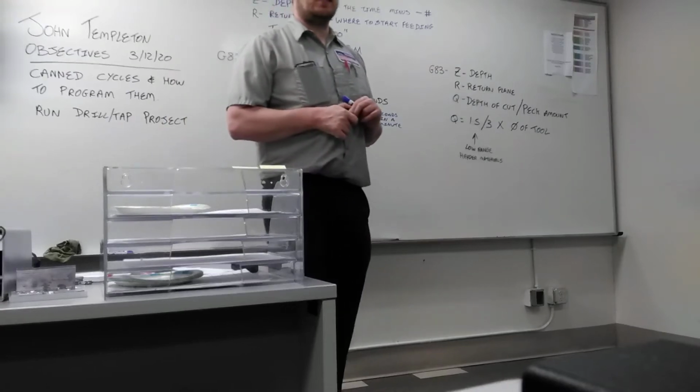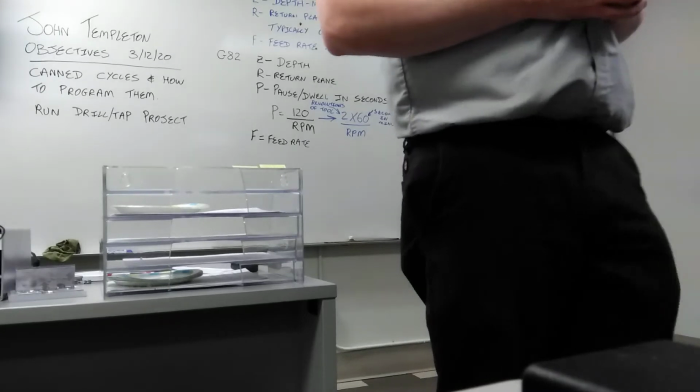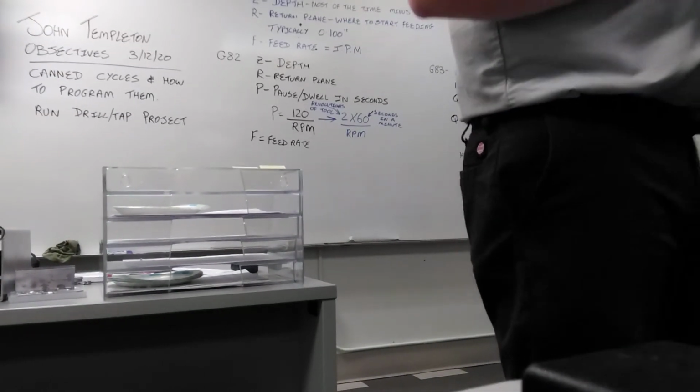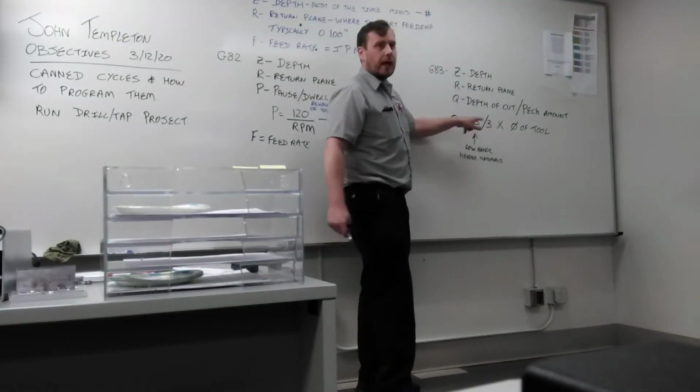Remember on that chart that I gave you? It gives you the Brinell hardness. What is that telling you? How hard the material is. The higher the number, the harder the material. The harder the material, go on that low end.